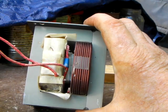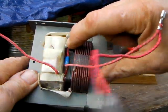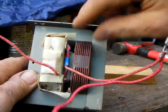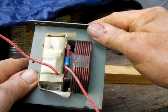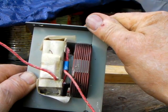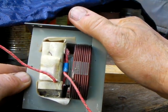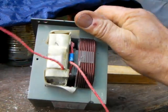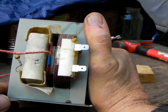Now the other thing this will give you is these windings here can be removed — they're just filament windings and they're not going to give you much, about three volts. You can pull these out and use some Teflon-covered wire and wind back in there another winding for bias. You can get up to 24 to 30 volts depending on how many turns you put in there, and that makes it useful for your bias circuit or even to power relays and stuff. That's it — just that simple, and this will almost double the power you can get out of a microwave oven transformer.